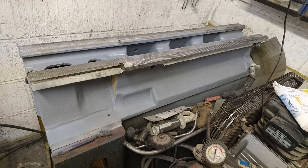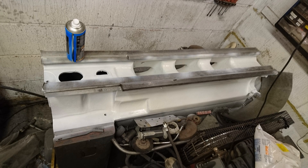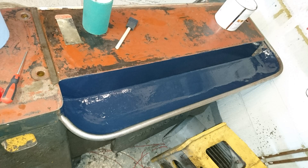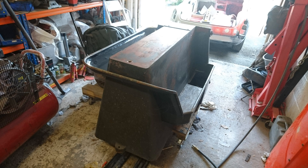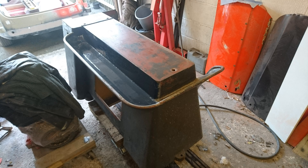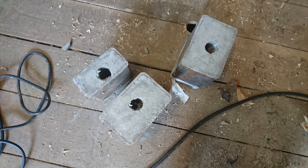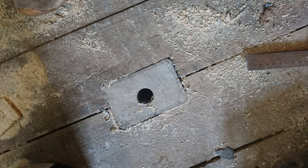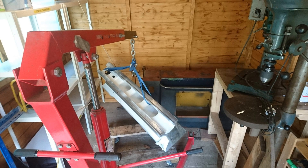I started on the bed. The bed had to be painted in situ because it's extremely heavy — the lathe weighs about half a ton all in. It all came out quite nicely. This is an induction hardened bed, so there wasn't a great deal of wear on it. The lathe sits on three concrete pads that I made — I injected cement into some steel box section with holes in, then cut them into the floor, because the floor wouldn't be able to handle the weight but the concrete underneath would. This lathe is quite strange — it sits on just three mounting points, and the ways also only sit on three, so it's sort of like a triangle on a triangle. It just keeps it balanced all the time, so you don't have twisted ways.